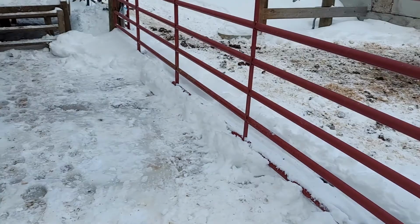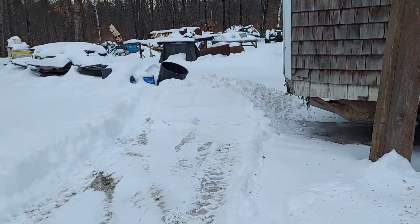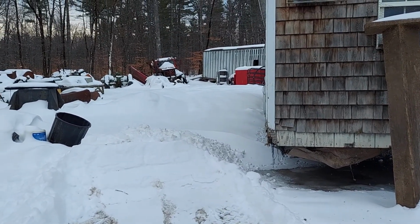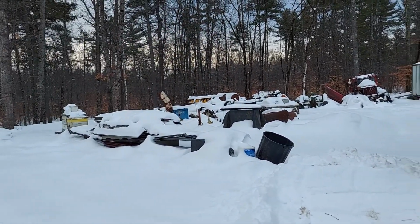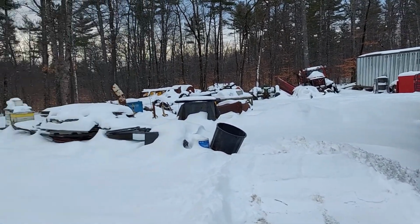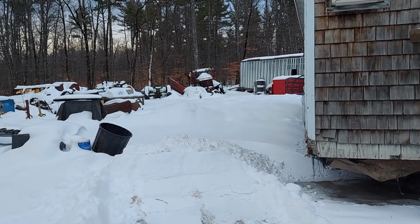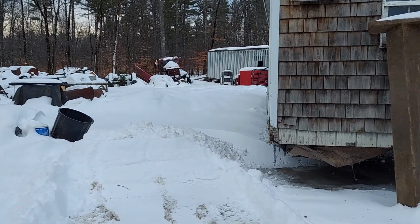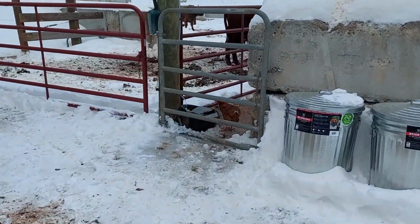When we build our new chicken coop and pig house over here, it'll be tied to this pad, and then I'll make the decision whether to run a separate drain, like a 6-inch HDPE drain pipe out there, daylight it and run some drains in the floor, or just run it all on the surface and right down this. The trouble with drain lines obviously is you've got wood chips, sawdust, and manure. You really need some sort of catch basin you can clean out, and sometimes it's easier just to keep it on the surface and slope your floor so it goes to one corner.